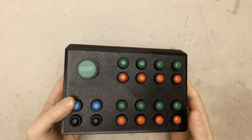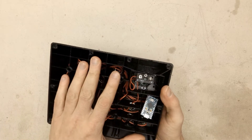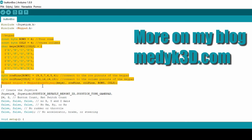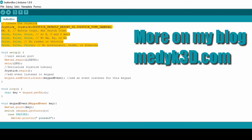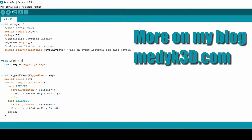Now I have all the buttons mounted and soldered. It's time to program the Arduino so the button box will work. Coding the Arduino is really easy — it is probably the easiest part of the whole build. First we need to add two libraries: keypad and joystick. We define the keypad variables and joystick and add some basic event handling. You can just download the source code from my blog and use Arduino IDE to upload it to the board — link in the description below.